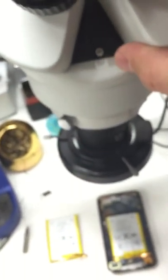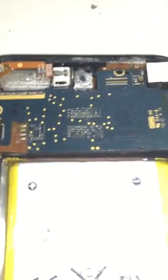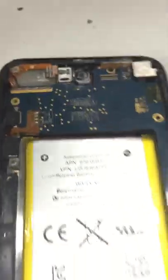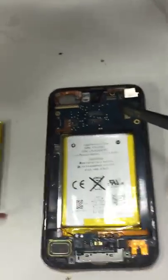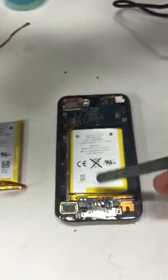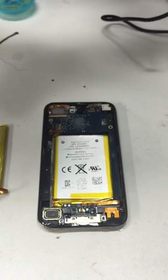If we were looking at this underneath a microscope while frozen, we could potentially isolate which component is shorted out by seeing where the freeze spray melts first. But in this iPod's case, I need to remove the logic board and the shield from the backside and see what it looks like under there. I suspect this iPod has been dropped in water, and unfortunately something on it is burned out. So we're going to take it apart and see if we can figure it out. Thanks for watching.